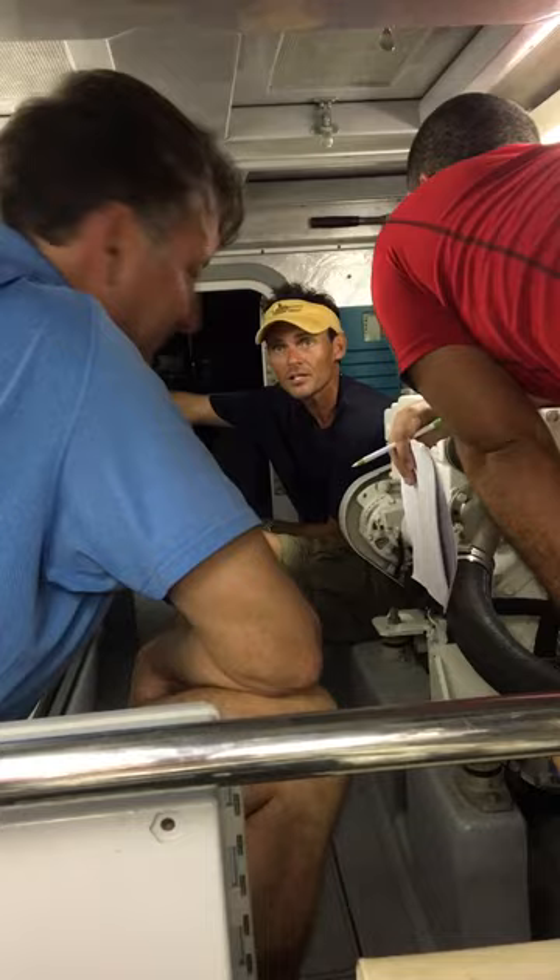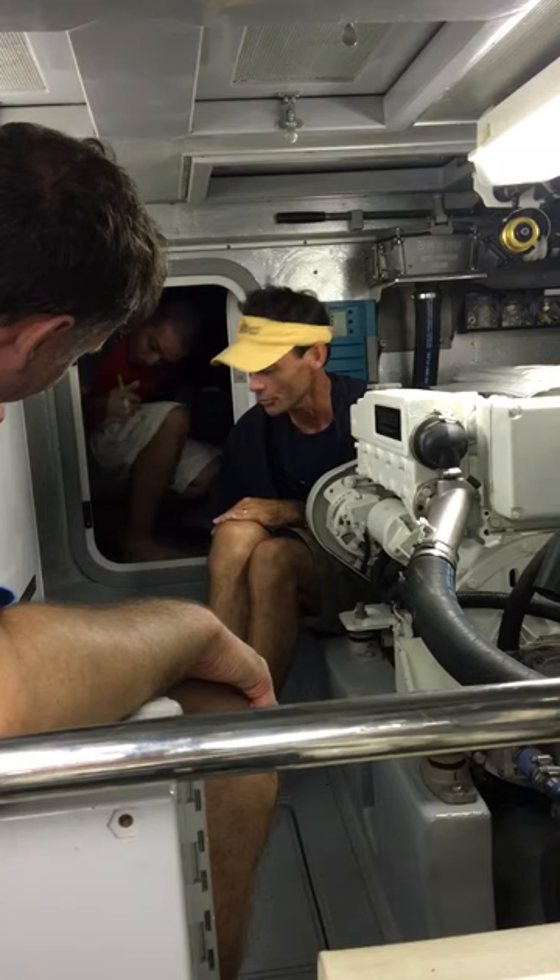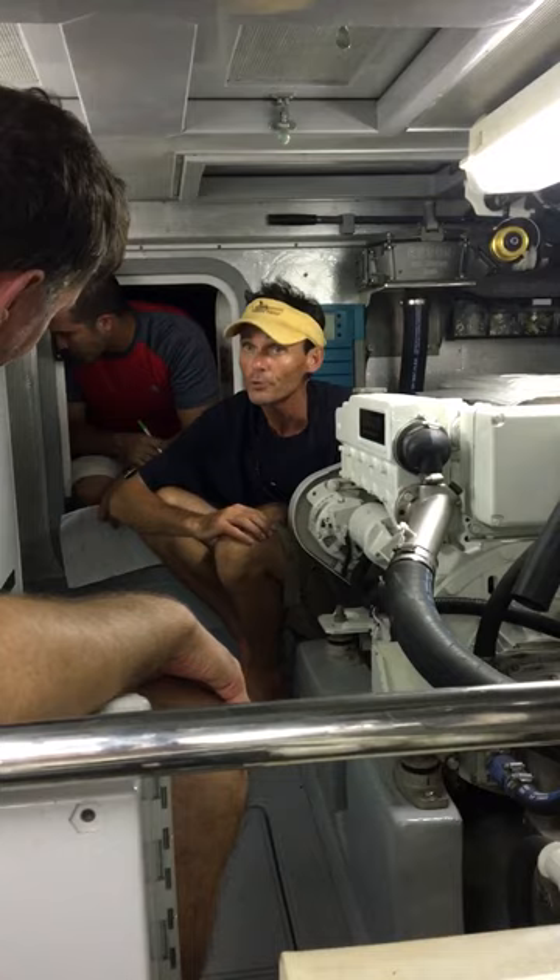It's up from the main bilge and it takes up the air conditioning condensate. So when the air conditioners are running, especially right now because it's so humid, you're going to have a lot of fresh water dribbling into the bilge from the air conditioners. A lot more than you might think. If the bilge pump is turned off, you're going to fill that bilge in a day with fresh water.